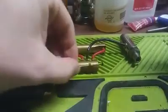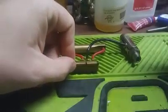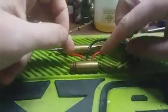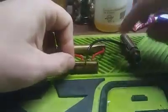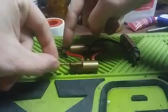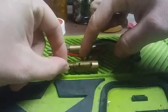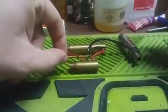With a slide frame — like we talked about in the beginning — you're starting by distributing to the front port and you're pulling backwards. So what you would do — and you've all seen diagrams of how to set up your hoses — if you're running this on a slide frame, you would take these two ram hoses and reverse them. When we're sitting at rest we'd be distributing air from the front barb on the three-way to the rear barb on the ram, holding everything shut. Then as we pull, the gun fires and we go back, sending air to the rear barb on the three-way which goes to the front barb on the ram.